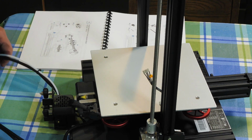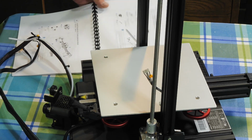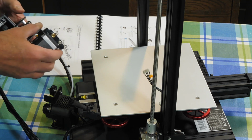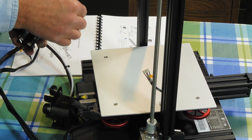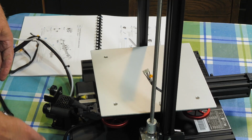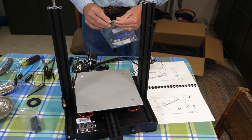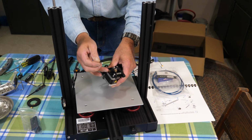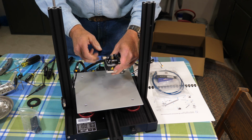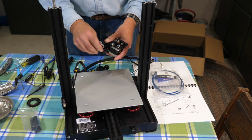And the next step is to install the pneumatic joint, the XC axis kit, and the synchronous belt. I'll have to go gather up my... Okay, this is where the Bowden tube feeds in, and the fitting for that needs to get put on there. And I'm going to be using the upgraded ones with the Capricorn. So I guess I'll grab that out of the package instead of having to try to swap them out later. And that screws right into this here. I'm not going to take that any more than finger tight for right now. Well, I guess I could tighten it. There's the wrench.